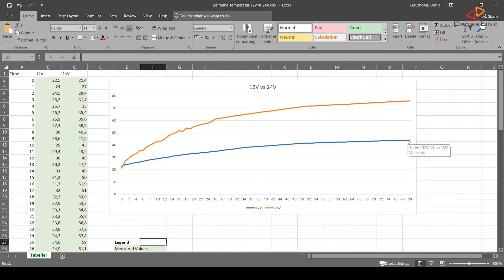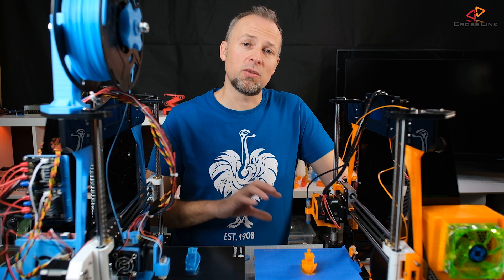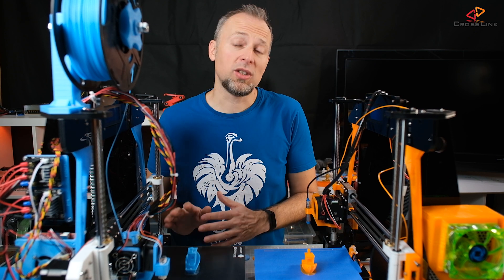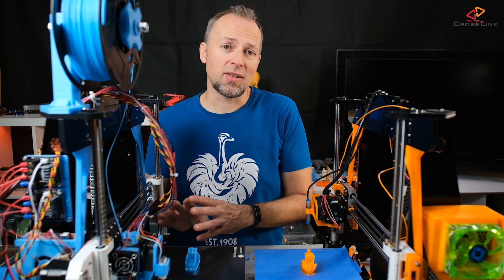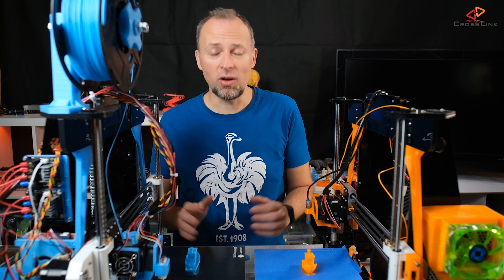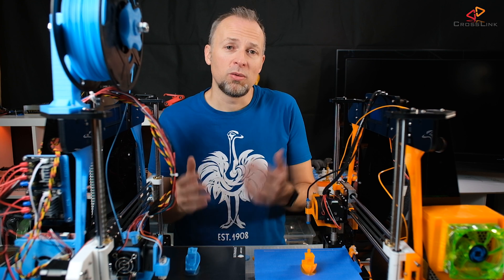The result clearly shows us that temperatures are much higher with the 24V version. If you're interested, you can download this spreadsheet — it's linked in the description below. I'm going to do a test with a replacement motor that is officially rated for 24 volts and see if that makes any difference. You could also add a cooling block or a little fan to lower the temperature. Whether the motor is going to fail at some point is the question. I'll look into the long-term results printing longer, and if any part fails I'll put it in the description or comments. So far I'd say it's still fine and you can go with 24V.